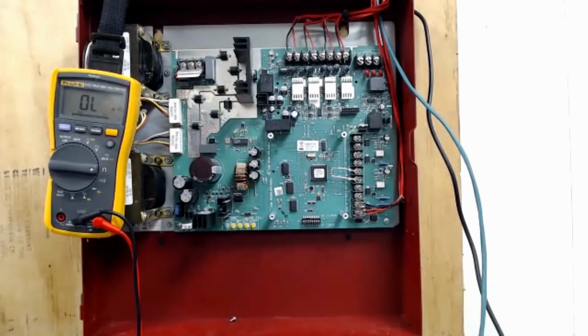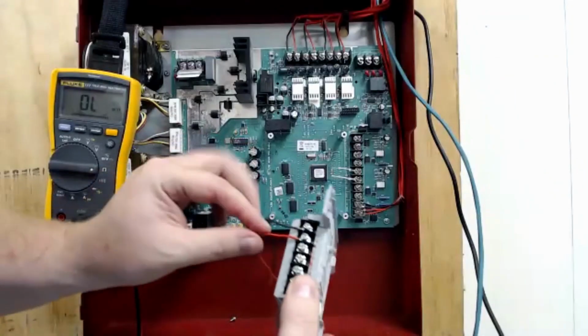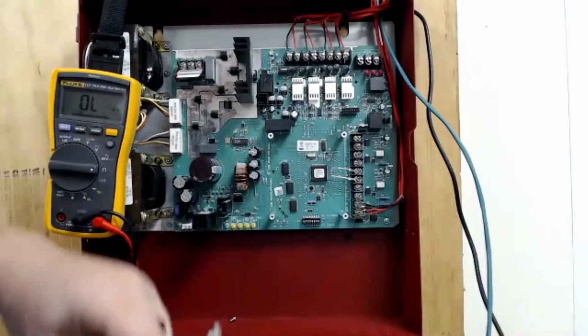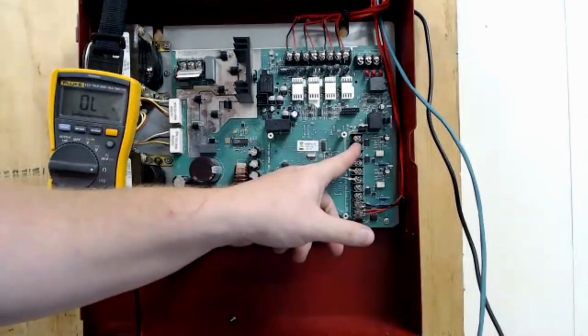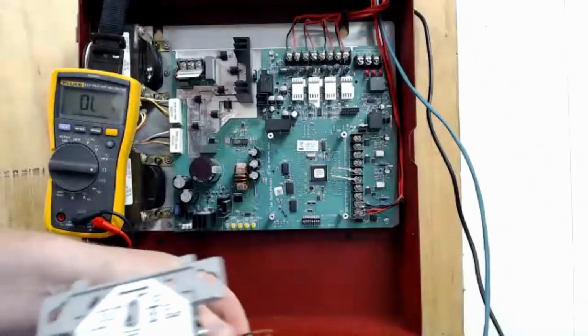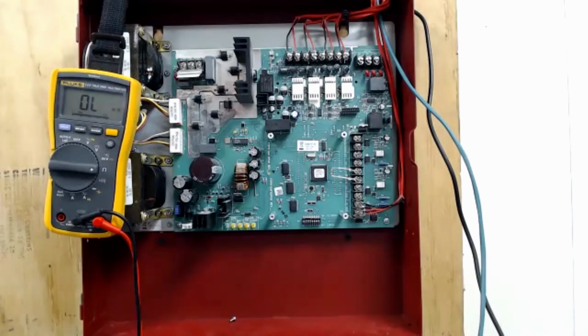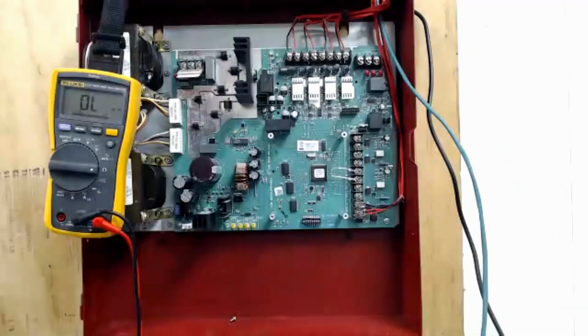All right, so on this control module, I've landed on these top two terminals. Negative is on top, positive is on bottom, so I just corresponded the red with black. The same is true of this power supply. The negative is the top screw, the positive is the next one down. So that should line up pretty well. And then I have to make an almost identical jumper so that I can come from this corner of it straight into that input.